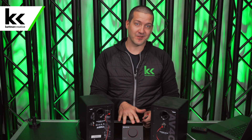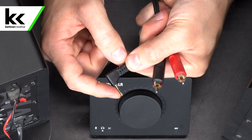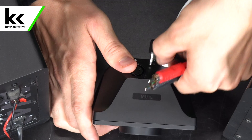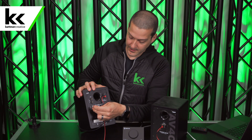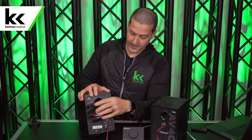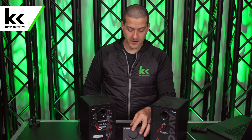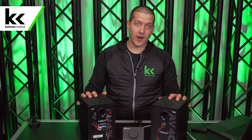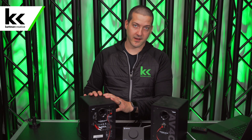For the seventh and last method — this is a long shot: your audio interface only has a headphone jack output and your speakers only have RCA inputs. This is increasingly rare, but we'll show you how. Connect the eighth-inch headphone jack connector, then attach the two RCA cables to the back of the powered monitor — red to the right side and black to the left side. Select your speaker controls, turn it up, and you'll get stereo output from your audio interface via an unbalanced headphone-jack-to-RCA connection.